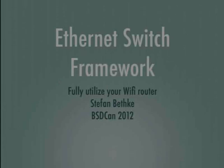So I immediately started looking at that and noticed that this particular piece of hardware has a switch chip which is not properly initialized by the bootloader. So in order to really use it as a wireless router, you need to somehow initialize the switch. So I figured, well, I'm somewhat familiar with the OpenWRT code, so why don't I give it a shot and see if I can come up with some kind of driver that does the initialization and maybe some VLAN type of configuration. That's what led to this talk.